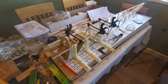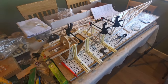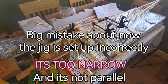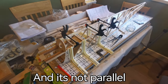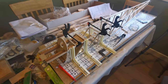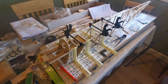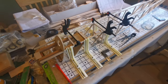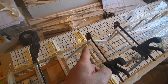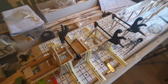Here we have it. This is the fuselage in the jig and I've now glued in all the cross pieces for the front part of the fuselage which is parallel. The part which will pull in at the back I'll wait till this is thoroughly dry before beginning that process and I'll flip the whole fuselage over and put it flat in the jig to do that, cutting the cross pieces in pairs. I also intend putting a diagonal brace across these members because for a tiny amount of weight it'll add substantially to the strength.